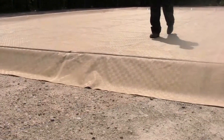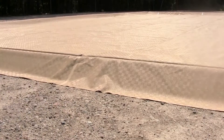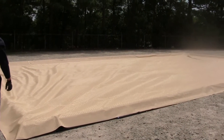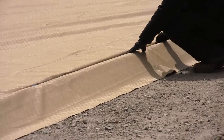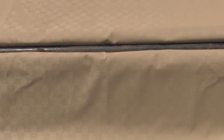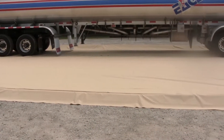The rugged liner material for this Ultra Containment Berm is a textured, slip-resistant PVC material that is available in 38 or 54 mil thicknesses. With the liner material properly placed on top of the containment area and foam support blocks, place 1-inch steel rod or rebar on top of the material and into the slots in the top of the blocks. This will help secure the material and keep it in place during day-to-day operations.